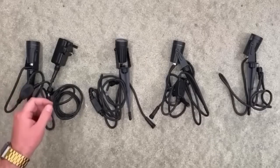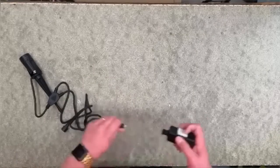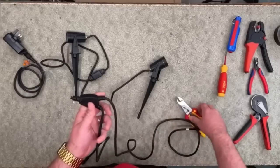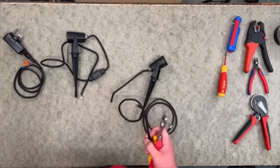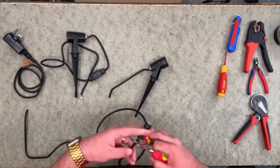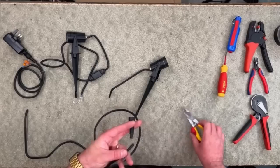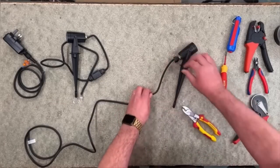We've got our lights but they're not the right voltage. Well, I thought it was getting mains voltage, so we're going to have to convert this pre-assembled kit — it had everything wrong with it. It's loop-in and loop-out. We've got a converter to four separate lights, so we're just recycling the cable and joining them back onto the fixtures so each one can be individually controlled by the RF Solutions RIOT.